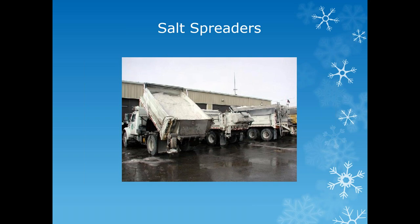Under the diminishing load clause, for snow and ice operations we can be over-dimensional and overweight as long as we have our strobe lights on. We see our trucks running snow plow blades during summer work always run strobe lights. ODOT also beefed up their trucks—newer generation trucks have stronger frames and stronger axles, so they're properly rated to handle the bed load on the rear axle. A side benefit has been increased longevity of equipment, as the heavier-duty trucks aren't being beat up as badly.